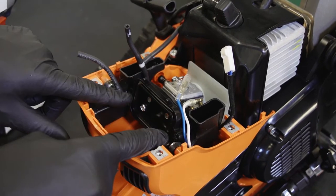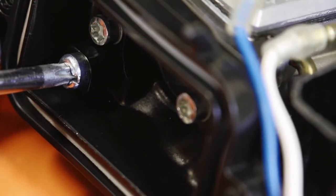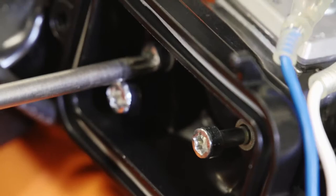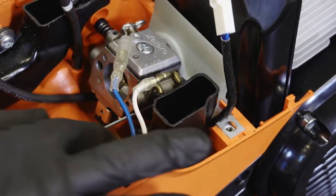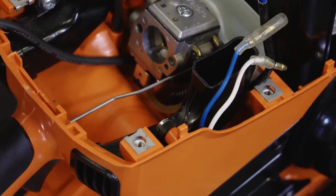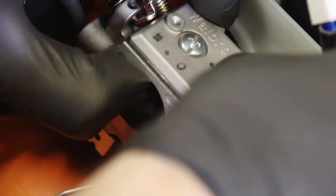Next, remove the carburetor inlet by taking out two screws: one located at the three o'clock position, one at the nine o'clock position. Do not tamper with this screw. Again, use a T25 Torx driver. Lift the air inlet assembly out of the way. Now remove the air inlet tube — this is just to open up the area to see what's going on; in actual repairs and diagnostics this isn't necessary. Pull the carburetor away from the carburetor retaining flange and separate the hoses.